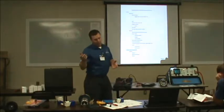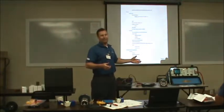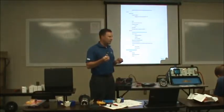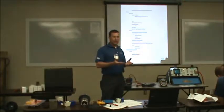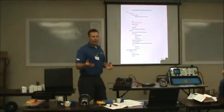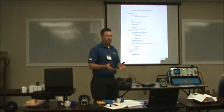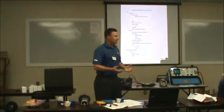When we get motors in, what we like to see is them read plumb off the chart. We call it infinity. But they don't a lot of times, and usually this is caused by moisture. I can see low resistance readings being caused by moisture. I can cure those problems by simply warming the motor up. A lot of times all you gotta do is start the motor. If you're testing the motor and getting a pretty low resistance to ground, start the motor and let it run until it dries out and test it again, if it's still running.